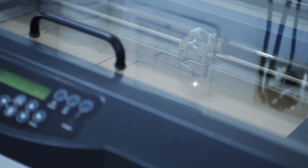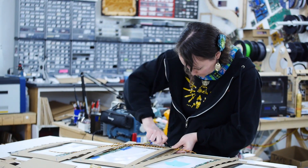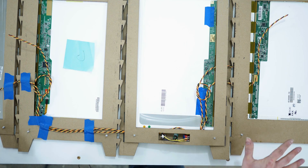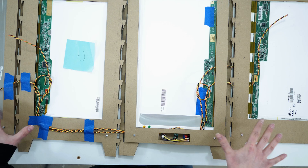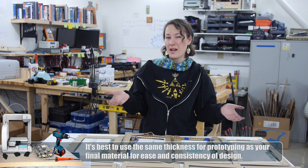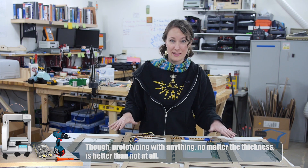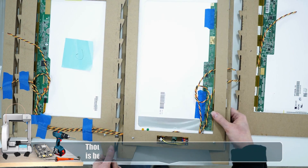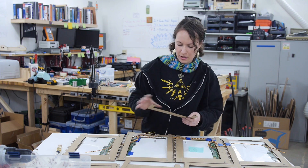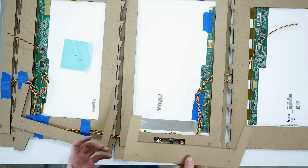After Felix gave me a rough idea of where the wires were going to go in the case, I designed a prototype of the lamp in Illustrator and laser cut my pieces out of chipboard. I'm going to use this cheaper material first before cutting the final version in MDF, because there are a lot of problems that can come up during the design process. We got the basic design for the frame done, and I really wanted to do a base prototype so I could see how we're going to do the wiring — I want it to be a more finished design, so I'm going to see if I can hide the wires within the frame. We have a full front layer on the face and a full complete frame on the back, with layers in between that hold the LCD in place, essentially acting as brackets.